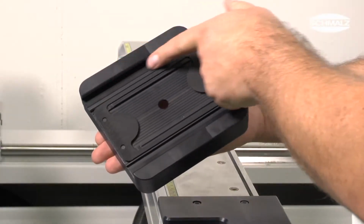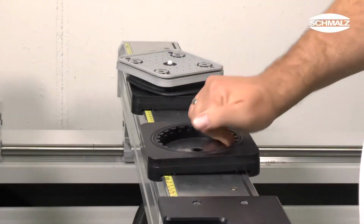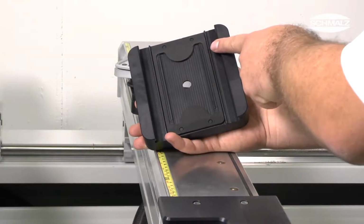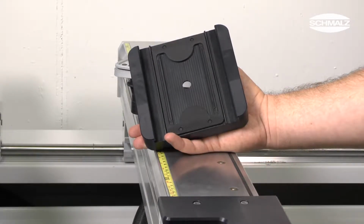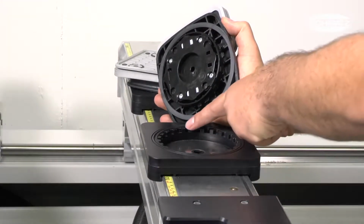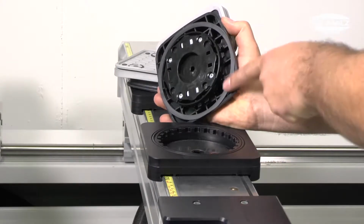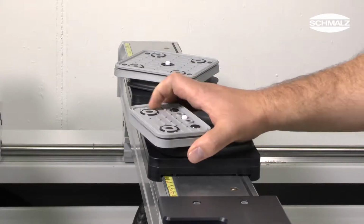The dovetails on the side are designed to come on and off easily, but still sit tight on the console. This bar opens the ball valves. The rubber gasket makes sure the activated vacuum stays intact. These inlets on the top side of the APS4 take on these noses on the bottom of the vacuum block. They make sure the block is secure in every position.